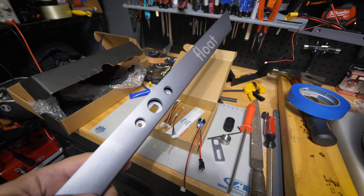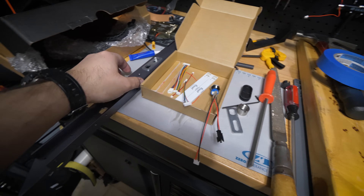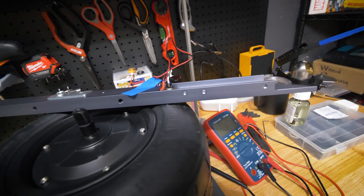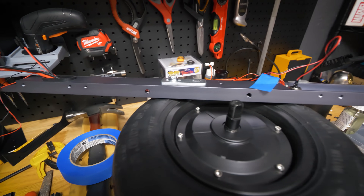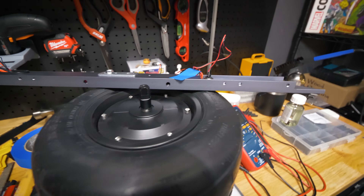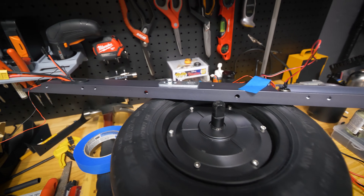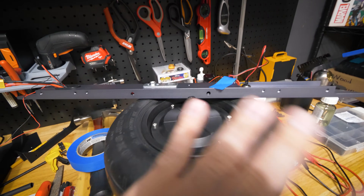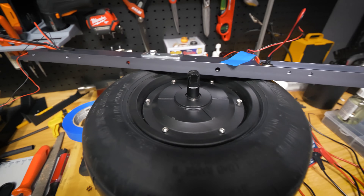The rails are very well made externally, but internally they're not perfectly finished. Where you have screw holes in the rail you have some artifacts of the drilling and tapping, and those need to be addressed before you thread wiring through. There were some hanging pieces of aluminum in there, which was not a good thing. When I removed the main power cable there were some slices in the silicone jacketing of the wire. I desoldered that end, took the connector off, and fixed the wire — it didn't cut through to the actual strands, but there were scratches and slices, so I covered it all over with heat shrink tubing and resoldered it back together.